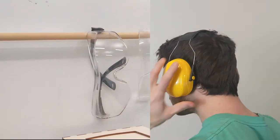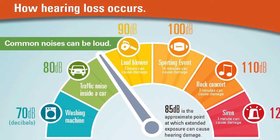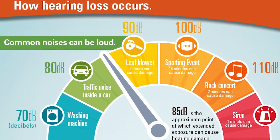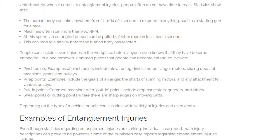Safety glasses and hearing protection are mandatory in the ShopBot room. The machine operates at around 84 decibels, the exhaust system at around 80 decibels, and combined on a logarithmic scale you're closing in on 87 decibels — loud enough to cause hearing damage with prolonged exposure. Noise-canceling headphones do not provide any meaningful level of hearing protection and do not satisfy this requirement. Another serious risk is entanglement: the spindle operates at 18,000 RPM, and if anything on your person comes into contact with it during operation, you could be pulled in — faster than any human reaction time can prevent.